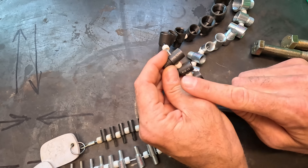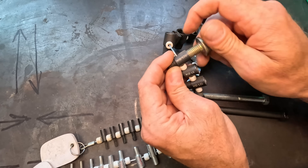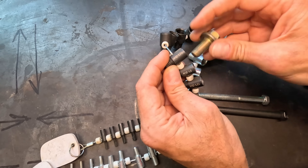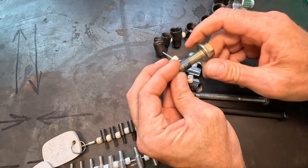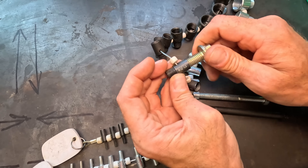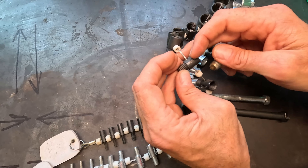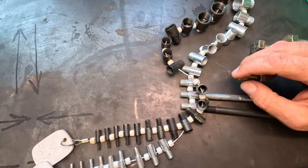That's the spacing from thread to thread. Let's figure out which one it goes into. It looks like it's M12 by 1.75. I try to put it in the M12 by 1.5 — it starts, but it stops; it's snug. That's too small a threading. So these things are a lifesaver and help you organize bolts and quickly figure out what size they are.